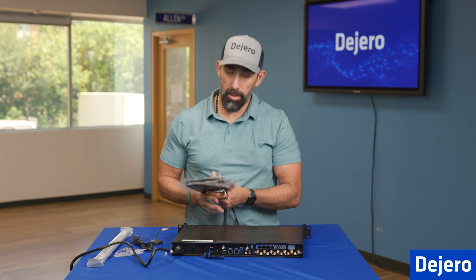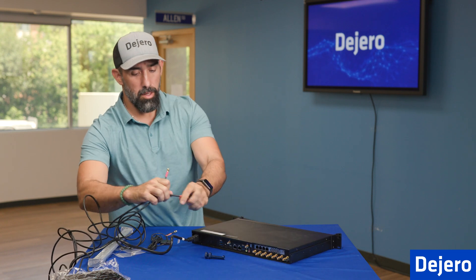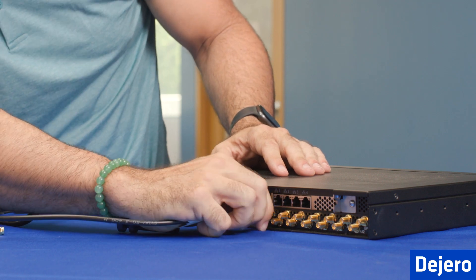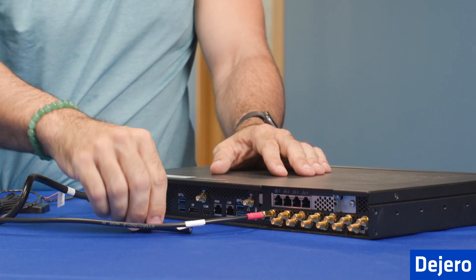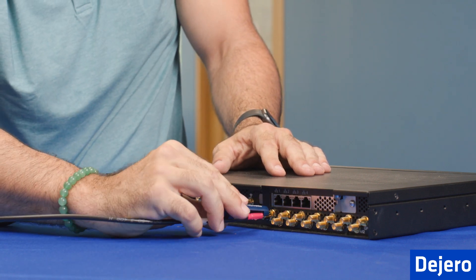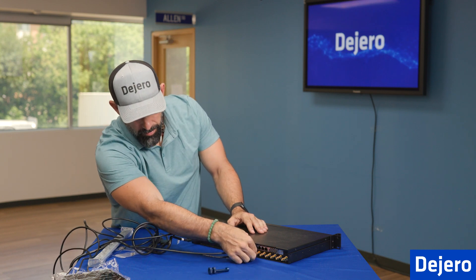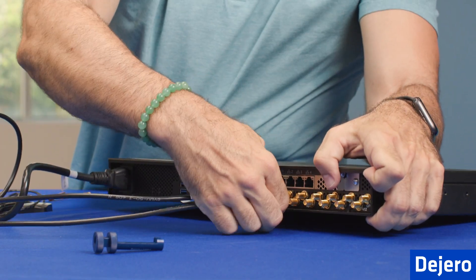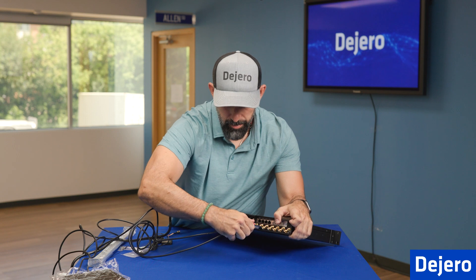I've brought over a GPS antenna and one of our LTE antennas, and I will connect the other LTE antennas shortly. If you have any questions on which antennas to use with our gateway, we have an antenna guide available on our support hub. With the SMA connections, all we're going to do is simply connect on the back. What I like to do is hand tighten first, then use the SMA wrench to slide over the cable and tighten further with the wrench. Once done with that single connection, I move on to my next connection, then grab the rest of the antennas and repeat this process.